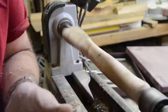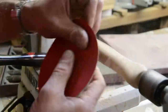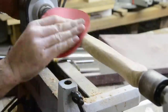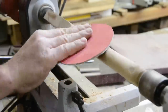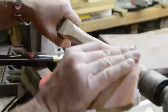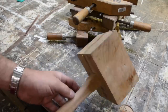When it comes to lathe work I go as slow as possible until I get to where I want. Now I'm finally where I need to be and I'm using a very rough paper. After spinning it I kind of sanded straight - you'll see me do it on the head as well. They're really swirl marks, which are kind of hard to avoid when the wood is spinning and you're sanding it. I think I'm liking it - I'll do a test fit now while the glue is drying on the mallet head.